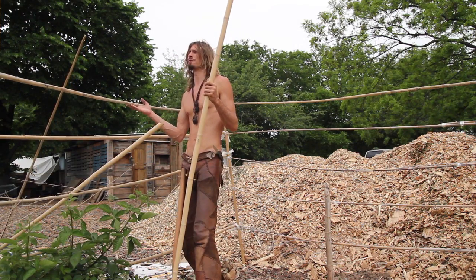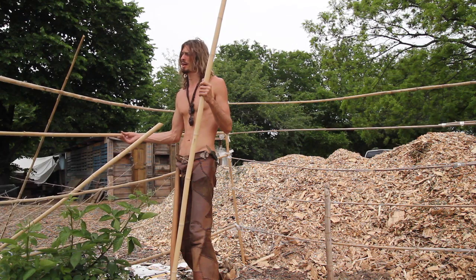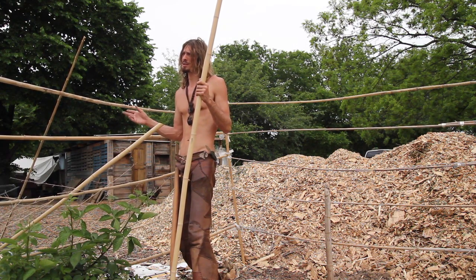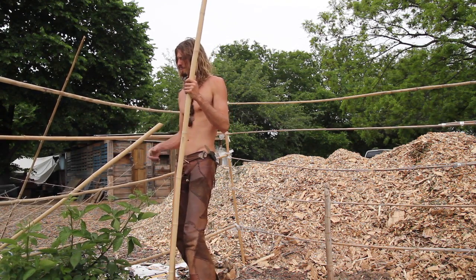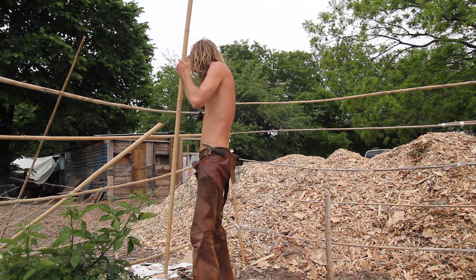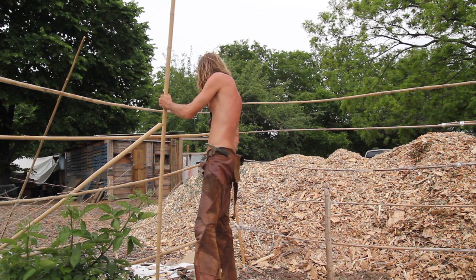So this wall is pretty weak and flimsy. It's got relatively thin horizontal connectors, which is fine. We want to use the thinner ones for the horizontal connectors, but it's sagging in the middle because there's not enough vertical support. So I'm probably going to add 2 to this one because it's pretty weak.